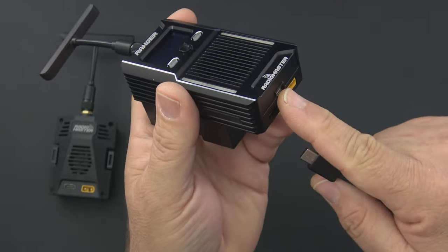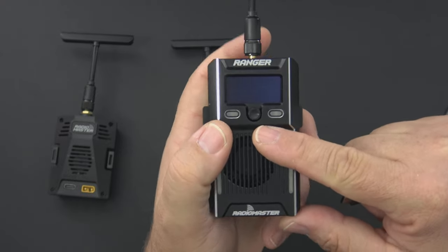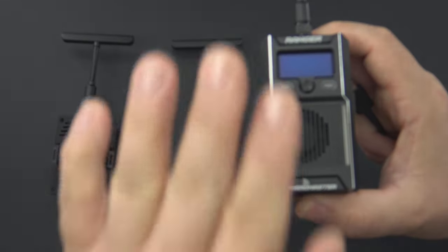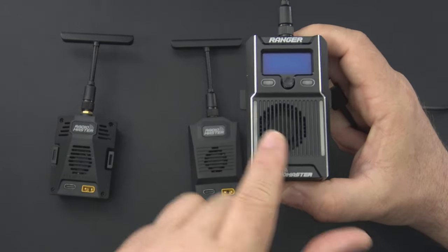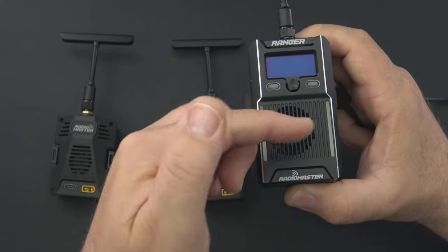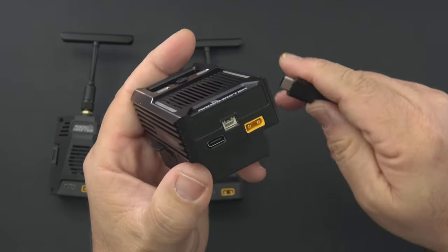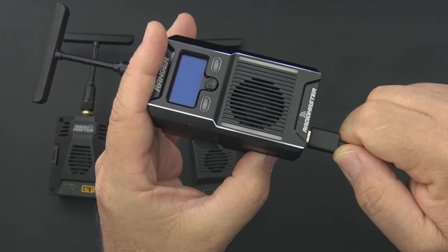Now, one of the reasons I really like Radio Master is because you don't need to configure dip switches. Some of these transmitters, you have to open the case and set some dip switches. I didn't put a link in the description. I forgot to do that, but after the video's over, I'll go back and put it in for you. You have to look at the wiki, and the wiki will show you what dip switches for what boards. Depending on the board you have to set dip switches inside. That's one thing I really like about the Radio Master. They did away with all that. It'll automatically go into DFU mode and allow you to program via UART with just plugging in a USB-C cable.